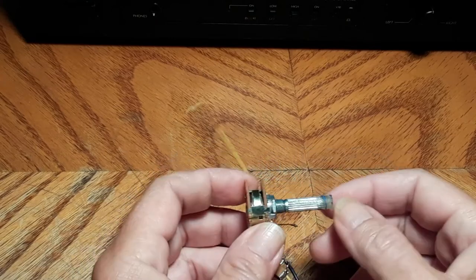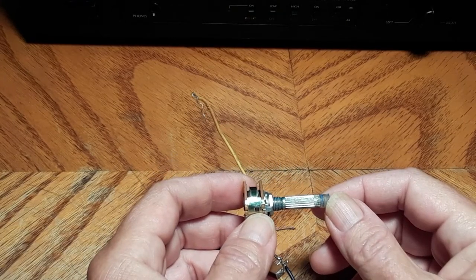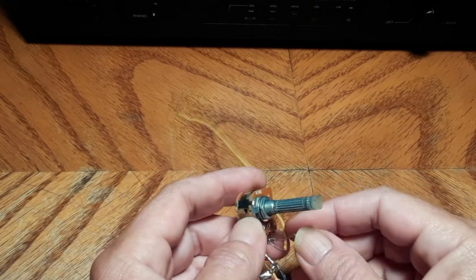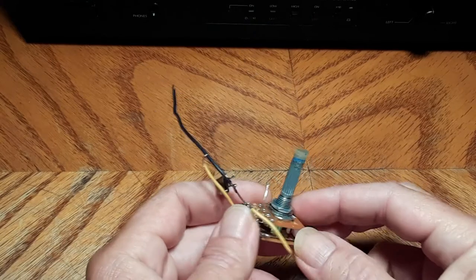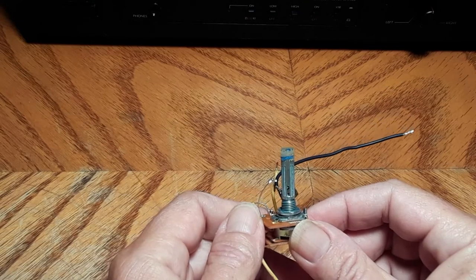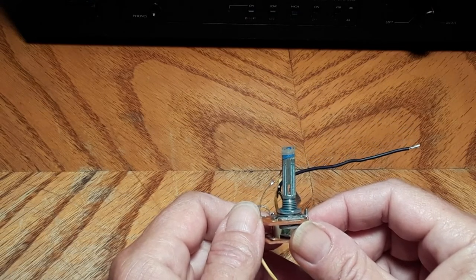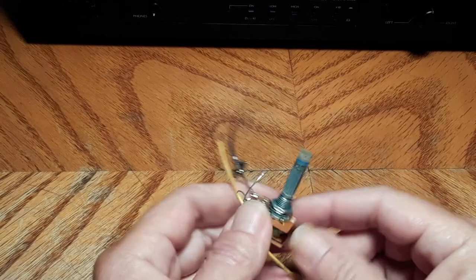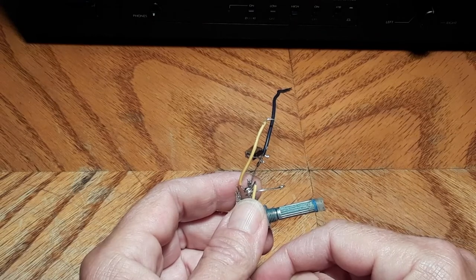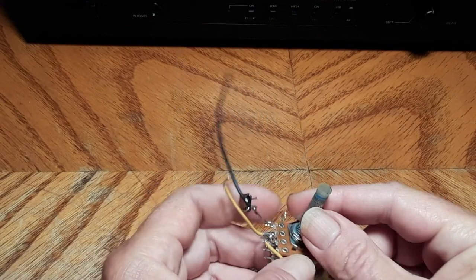Typically on these units you always run into the problem that you need around a 30mm shaft, but you don't have a 30mm pot. So what do you do? You make one. I'm not a mechanical engineer with a big tool shed, so I do what I basically can the easiest way I know how — and that's epoxy. I just wrap the shaft with masking tape and build that edge up with two-part epoxy.